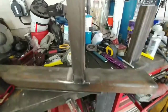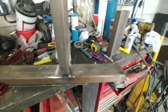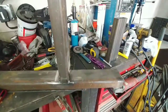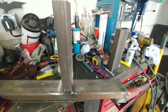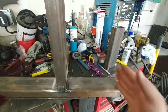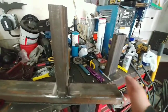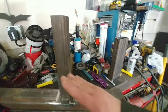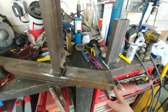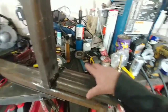So like I said, 12 inches from here to here — just to allow enough space for the leverage you're going to be putting on that bucket. You want a good bite on the inside of that bucket. You don't want to just be using the front edge; you want this thing underneath the whole bucket, otherwise you might bend the actual steel of the bucket itself.